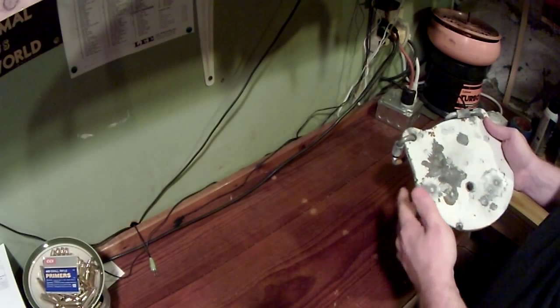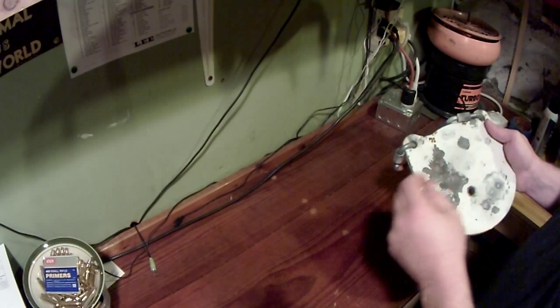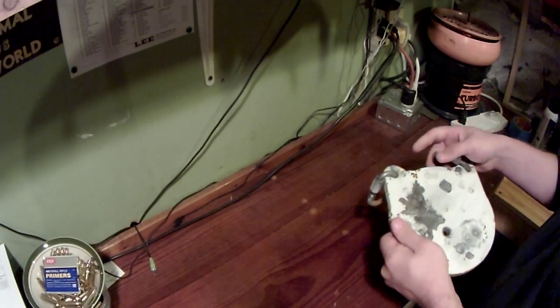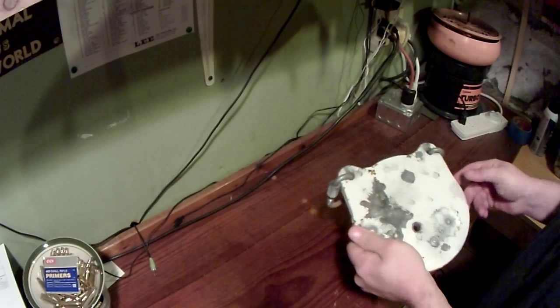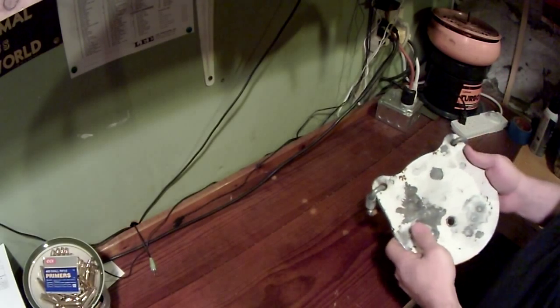I was reading that even water jets will give you a larger heat zone. It's not as pronounced, but it'll actually eat into it even more for the heat. And plasma is by far the worst, or a torch cut, because that puts heat farther into the material. The laser gives you a very, very small heat zone around the edge of it, so you have the most effective target area that's not going to get beat up.